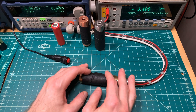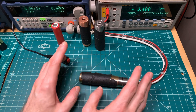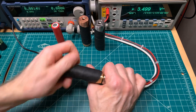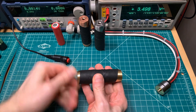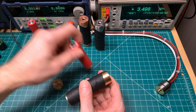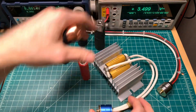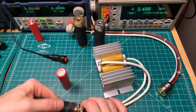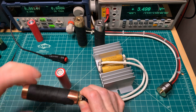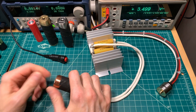I wouldn't expect any difference from what we got with the Tauren Max, which was very, very little arcing, but I want to test it anyway and be thorough. I'm going to do that on the copper one. All the contacts are the same — a silver ball and silver clutch plates. We'll use the Samsung 30T rewrapped and a 0.1 ohm load. I'll press the button 200 times and then take a look at the contacts. I'm not using the brass one because I want the grease in place to look at arcing the way you'd have it normally.